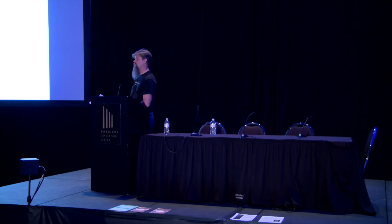What do you think? Your elements are toast. So re-element the whole thing. Take your resistance measurements and find out. AIM has those numbers. If you're 10% higher than what it should be, my guess is you're a lot more than that. You just need to change your elements and they'll go back again. That's assuming you have the right power coming in, of course. Correct. If power is stable, check your resistance. Okay, thank you.